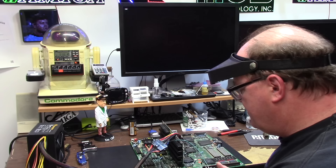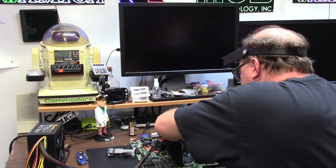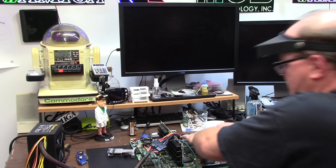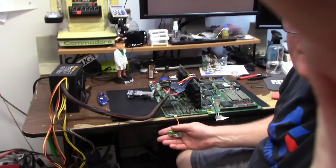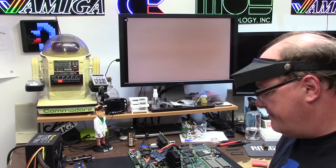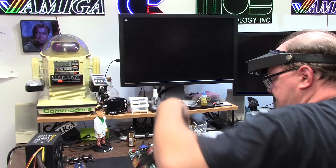Oh, we were better off before the socket — we could have booted ROMs. Damn it. First thing I'm doing — taking the ROMs out. Here's my 204. We'll see what they do. 181, 180. Energize. Low, high — and blinking. Low, high — and blinking. We have a new Paula socket and a new Denise socket, but now I'm only getting 1, 2, 3, 4, 5, 6, 7 blinks — 5, 6, and a long blink. I don't know what that means. That means it doesn't work.